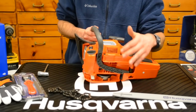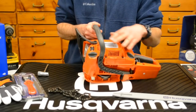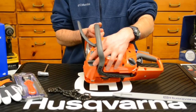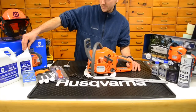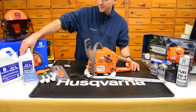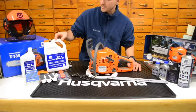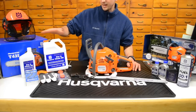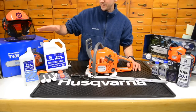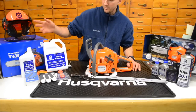This has an automatic chain-driven oiler, so anytime you accelerate with the chainsaw it will automatically apply oil to the bar and chain. Depending on what season you're in, it's a good idea to change your bar oil accordingly. Husqvarna has different bar chain oils you can use. Here's one of their standard bar oils — great for warmer temperatures, your 30s, 40s, or above. They also make a low-temp bar oil, which you'll see with the orange cap, great for cold temperatures like 32 degrees or below. Run the low-temp in the winter months. This one is a little harder to find — you'll need to look for a dealership or saw shop, as it's not readily available in stores.